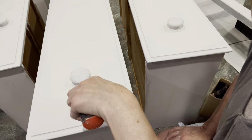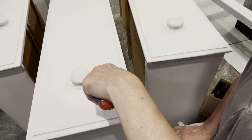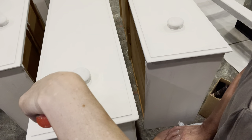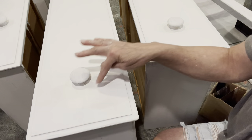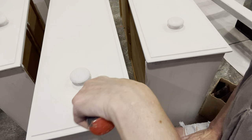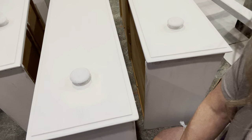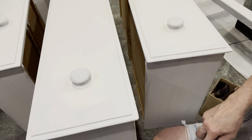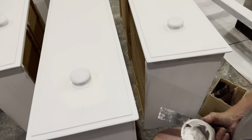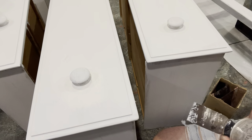Put it on very thin and pull it out. You'd rather put on more coats than try to get everything filled at once, especially if it's a deeper gouge — put on thinner coats and really pull it thin. What this is going to do is make that little raised edge disappear. This is going to eat up some of that difference in height, the different thicknesses from the paint down to the wood. It's going to bind to the surface because the product has binders to it. Dixie Mud is the bomb.